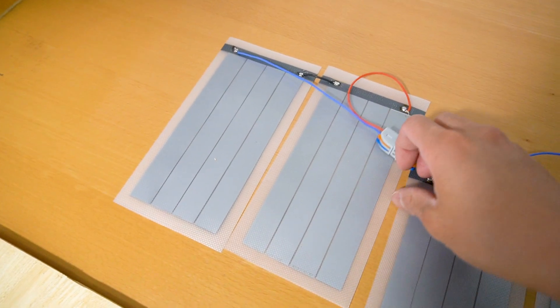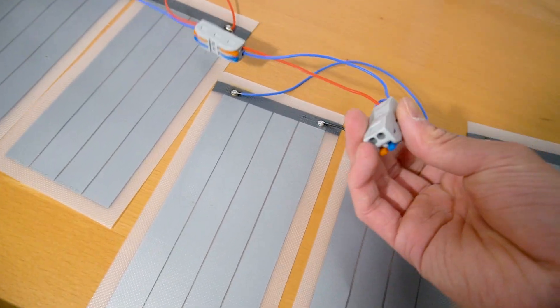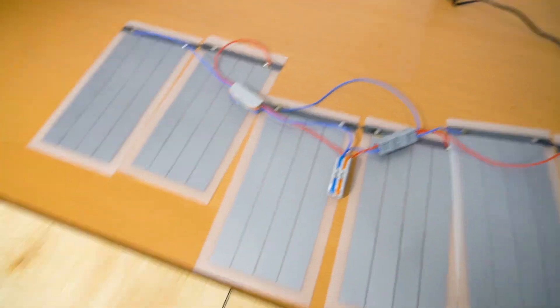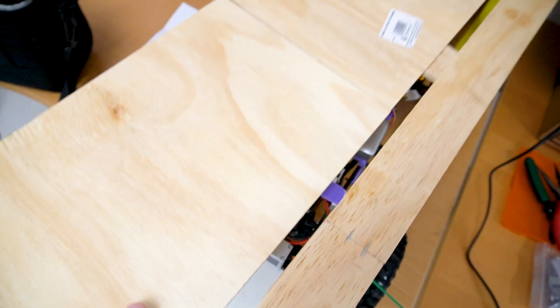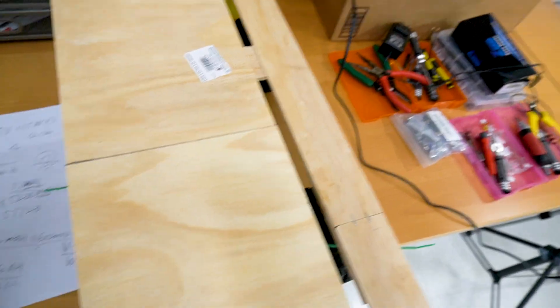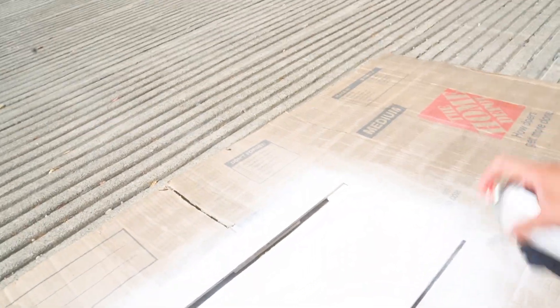I chose flexible waterproof solar panels designed for car camping. The advantage of using these flexible solar cells is that they are less likely to break if the car flips over, and they are more durable in rainy conditions because they're waterproof. I wired two panels in series and then connected three sets of these in parallel. According to the specs, this configuration should output enough current to sustain the crawler on a normal sunny day. However, I'm a little worried these panels will be less efficient than conventional monocrystalline glass panels. To mount them, I cut a board and coated it in white protective coating to prevent water from seeping into the wood. The white color also reduces heat buildup, making the solar panels operate more efficiently.